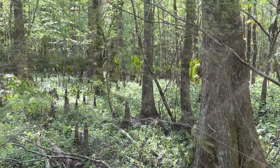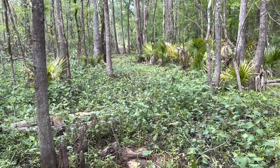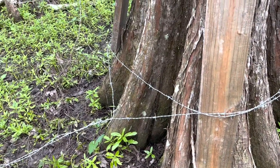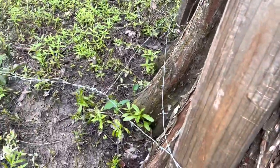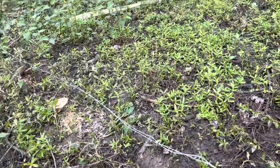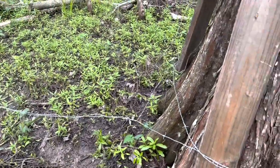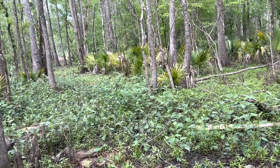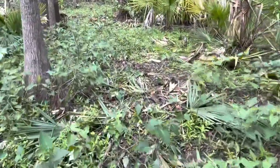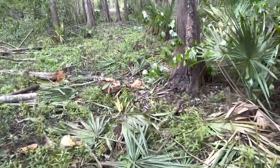I got that pulled out — it's pretty terrible to pull five or six hundred feet of barbed wire by hand through all that. One of the other things I like to do is double-wrap my posts, whatever kind of posts they are. In this case it's a tree, but I like to double-wrap so there's almost no strain on your knots. It looks kind of ugly since I didn't have my pliers to cut the tag, but it'll be alright. Wrapping it twice takes all the tension off the post. Then I'll trudge back through the swamp, strain this wire, and that'll give us our mark so we can come back with T-posts and set them in a nice straight line.